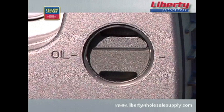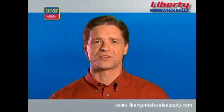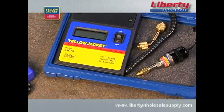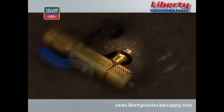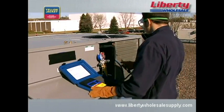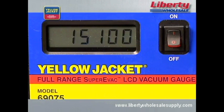It's important that the oil level remains steady when the pump is running for proper operation — about one-half to five-eighths up in the sight glass. If it falls too low, the vacuum pump could be damaged; if it's too high, it will increase the oil in the exhaust. Now connect the electronic vacuum gauge for accurate vacuum measurement. The best place to measure vacuum is at the system, not at the pump. With a combination vacuum and charging valve on your core removal tool, you can attach the electronic vacuum gauge directly to the system and isolate it from the pump, hoses, and manifold for a true indication of the vacuum in the system.